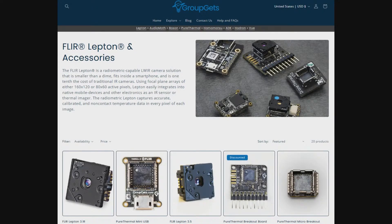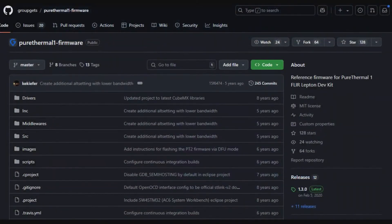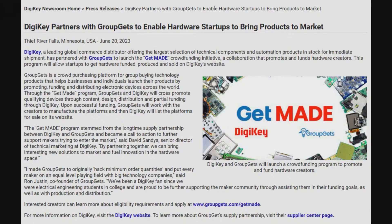If you don't want to get into all that, you can get FLIR Lepton accessories — breakout boards and dev boards available from GroupGets. For example, the PureThermal 3 provides USB video output. So you can get started — if you want to integrate this sensor but aren't sure it will work the way you want, or if it has the temperature range or field of view you need, you can pick this up, plug in your Lepton, and it just shows up like a little video monitor. They have example code and drivers for firmware and how to interface with it on a BeagleBone, Raspberry Pi, microcontroller, Arduino, etc. They even have some Python code. They work with DigiKey, which is perfect — you can get your modules from DigiKey and when you're ready for production, get the sockets and cameras from DigiKey. While you're prototyping, all those GroupGets parts are stocked at the DigiKey website so you can pick them all up at once.